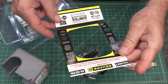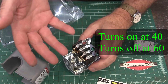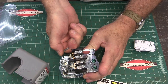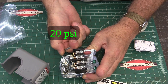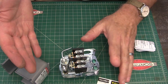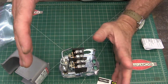It'll turn the pump off if the pressure gets below a set amount. Let's see what the range is — it's 40 to 60 PSI on the upper side. The way you do these is you just pull this up to start it and you can see those contactors going together, and you hold it until the pressure gets above the cutoff point. You let go and then it'll build up to 60 PSI and then it shuts off. When it comes back down below the set point, it'll kick back on.